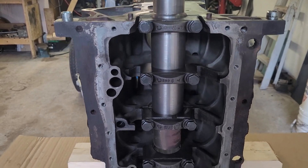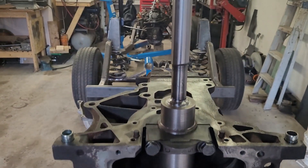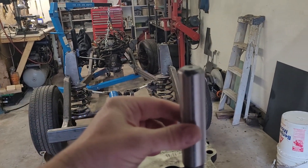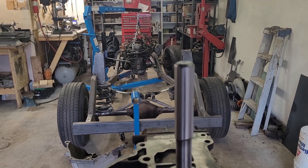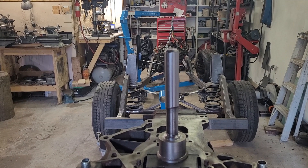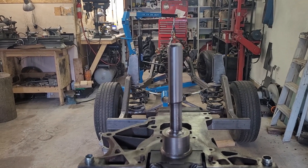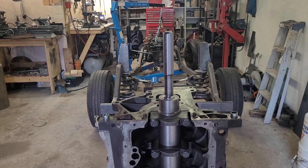Three of them — if that's enough, it doesn't have to go all the way down. This diameter here is the exact diameter of the input shaft bearing in the transmission. So now if I put the transmission on top of this engine, it will be aligned perfectly. All I have to do is make a connection between the engine block and the bell housing.